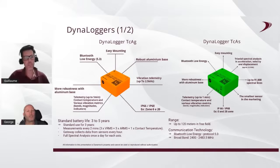Sorry, just going back to the TCAG. So yes, you developed a sensor that can measure global vibration and temperature, and it is a very cost-effective way of doing it. You mentioned bus bars there, where a customer could even put this in an MCC or a cold room or something like that, or even in an electrical panel, just to measure the ambient temperature there and capture the data. Because having a chat with a customer yesterday up in the Pilbara, there's a bit of a heat wave going through, and he mentioned 45, 50 degrees outside. So having a sensor like this in an electrical panel would give you the ability to wirelessly log the data, go back with your phone, extract the data, know what the temperature was in that panel over that time, or automate the solution through a gateway and know what the temperature is inside your MCC from the comfort of your desk. Is that how simple it is just with this?